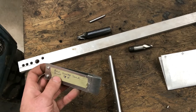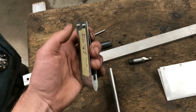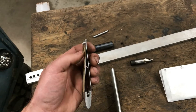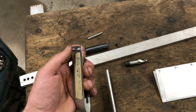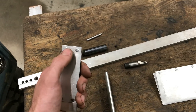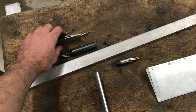Once it had dried I had it in my jig — you can see my other video of the jig — it squished the two skins together and the adhesive held it in place so that I could then punch these holes and rivet them. I used solid rivets on the actual blades.